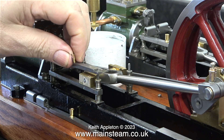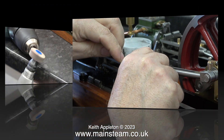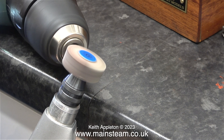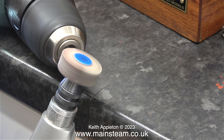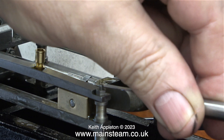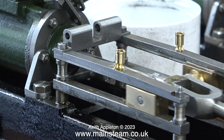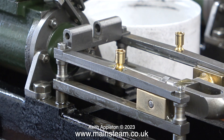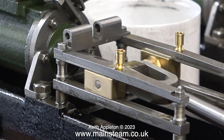In this clip I'm temporarily refitting the guide bar and testing the fit. At this stage it's almost perfect but it needed just a tiny bit more metal removing from the spacer. This method is more accurate than it looks — I'm holding the electric drill down onto the bench and holding the Proxxon against the side of the bench. This time the clearance between the crosshead block and the guide bars is just about perfect with no shake at all. To test it properly you do have to bolt down the top guide bar, and here I'm rotating the engine to verify it's not rattling at all.